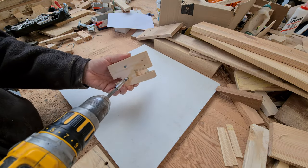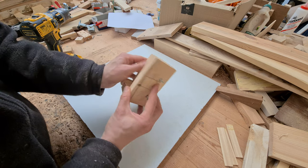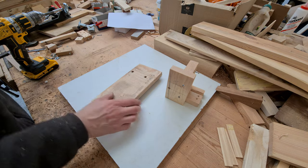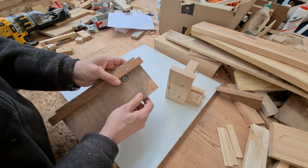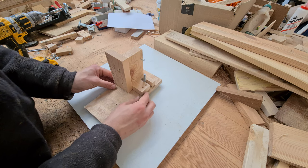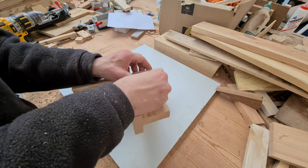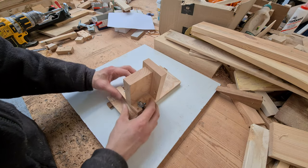I'm using an H-piece for the lower assembly where the channels will allow for micro adjustment on the platform. The first upright is for support and also to anchor elastic bands. The second upright will house the segment holder itself. Both uprights are fixed to the H-piece only, and that allows some adjustments to be made and ensures that the holder is at right angles to the direction of travel through the bandsaw blade. I'm using bolts with wing nuts to hold the main assembly onto the platform, and in this design you can move the main assembly closer or further away from the blade, and also slightly rotate it to ensure the segment holder is perpendicular to the direction of travel.